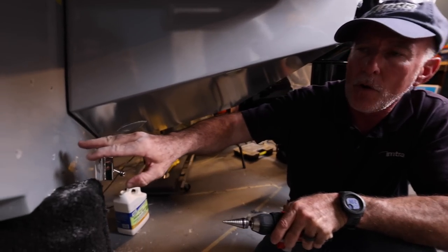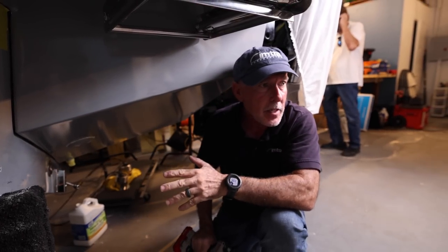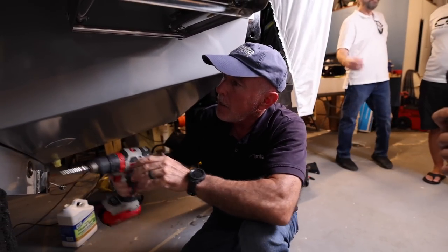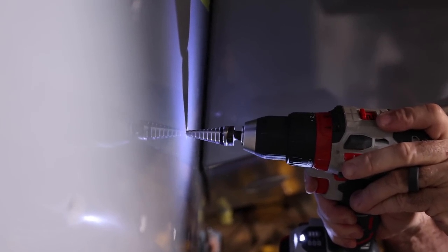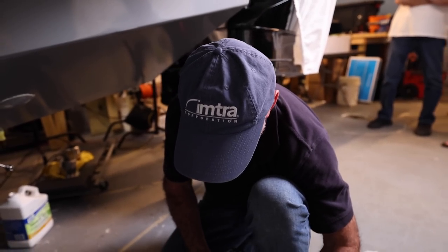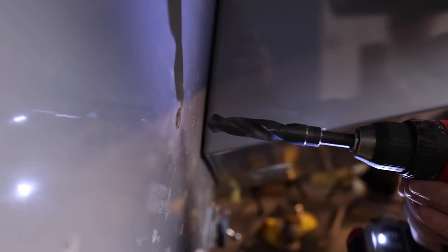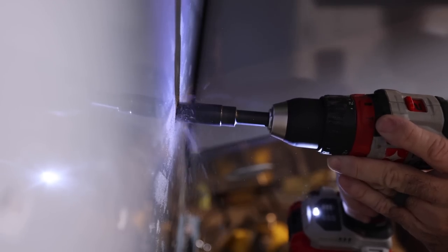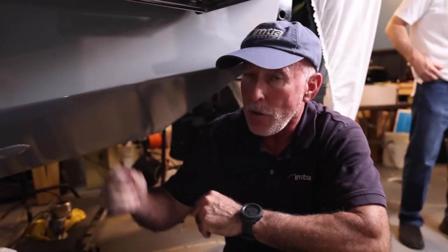We've made our holes for the mounting screws. We have one hole left to do. We've already checked with our drill bit that we have access right through the boat to a clear area behind the transom. Now we're going to extend the cable hole to 19 millimeters or three-quarter inch to accept the waterproof cable gland. I'm using a step drill bit — it stops the drill bit from walking around. Once I get to about 19mm I change to a regular three-quarter bit. Now we have a nice clean 19mm hole. We can vacuum up and get ready for the next step.